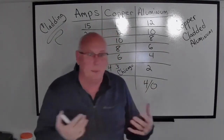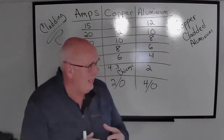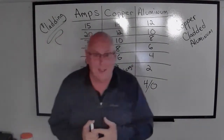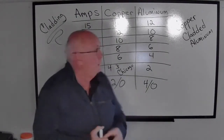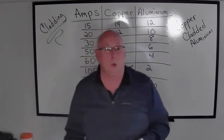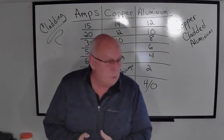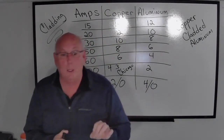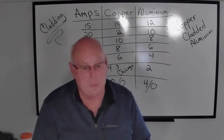So I always like to ask a little bit of a test question whenever I'm doing these classes, and I know we really can't answer them right here, so I'm going to end up giving you the answer. If I had, let's say, 100 feet wire, two of them, one of them was a solid copper wire, and we're going to say it's a 14 gauge solid copper wire, 100 feet long. And then right next to it, I had another 100 foot long copper cladded aluminum wire, same size. They're both 14 gauge. They're both the same distance. They both have 120 volts pushing the electricity to them. They have the same amount of draw at the other end. So I always try to ask the question, which one is the electricity going to travel the fastest on? Is it going to be the copper cladded aluminum, or is it going to be the solid copper wire? And I usually get a mix of both, but if you take into account that skin effect, they're both going to be the same, or at least they should be the same when we come with it.